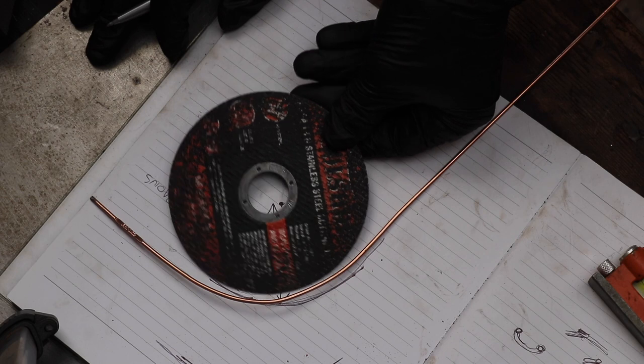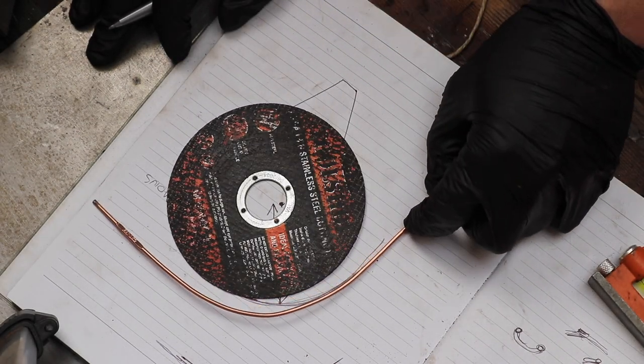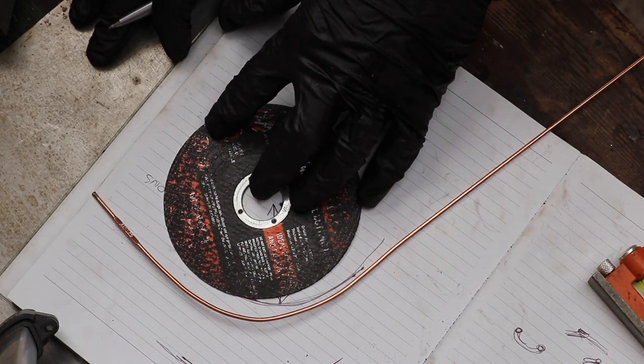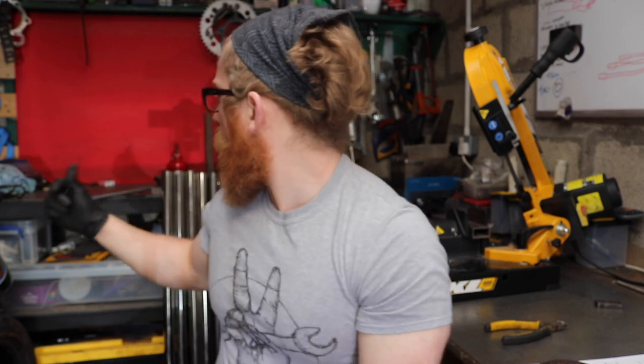I think yesterday I mentioned I need 10 degrees for a 90 degree radius. I need close to 60 cuts, because we've got 90 degrees at the top, 90 degrees at the bottom to go underneath the bike. So quite a lot of cuts to make. I've been watching a video by the Fabrication Series, again a very helpful one, I've linked that in the description, as to how to easily set up your bandsaw with a stop.